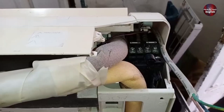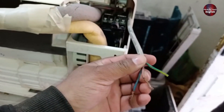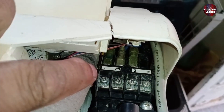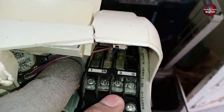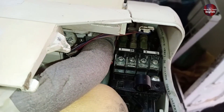Look at the unit's wiring connections. This is the indoor unit, and the supply first goes to the indoor unit and then to the outdoor unit. This is the main supply. At point 1, there's always the line. Point 2 is for 2N, which is the neutral, and point 3 is the signal wire, or communication wire. Now we'll make the connections here and show you how to do it properly.